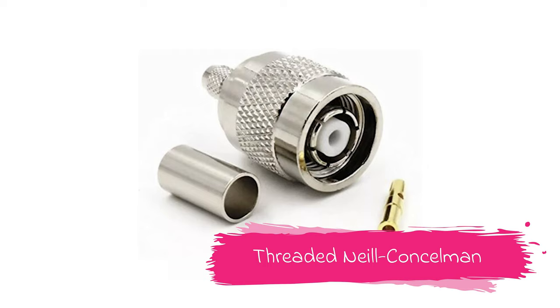It's not just SMA connectors. The Wi-Fi routers, particularly the older Linksys 2.4 gigahertz routers that came with detachable antennas, have what you call TNC — Threaded Neill–Concelman connectors. These are also reverse pinned, and you had to get special adapters for them. That's how you connect the Wi-Fi router, and these adapters are pretty much available on Amazon and a lot of different retailers.